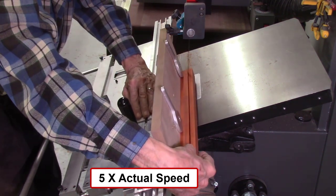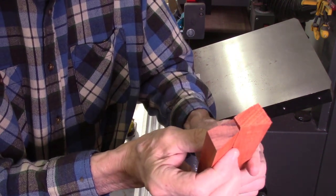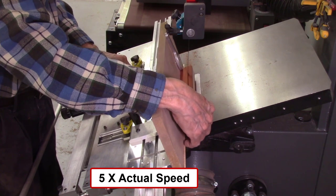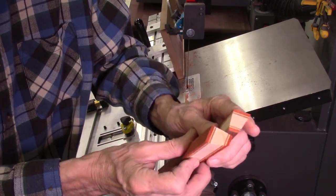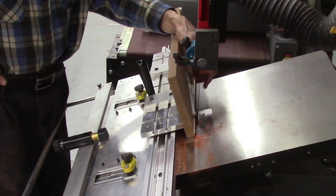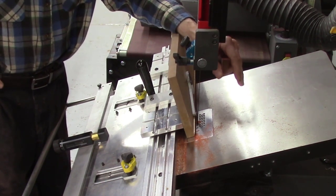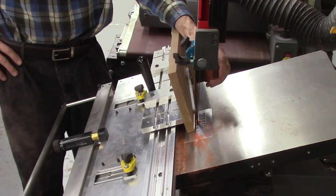I verify my boards are the same thickness at both ends. After slicing the multilayer board, I have two matching multilayer boards cut on the bandsaw. After slicing these 18-segment staves, I determined I needed to increase the number of staves to 20 in order to get the alternating pattern of segments. I changed from 18 segments per ring to 20 segments per ring by changing my bandsaw table angle to 72 degrees, giving me 18 degrees on my wedges. I'm now trimming the existing wedges down to 18 degrees using the same jig.